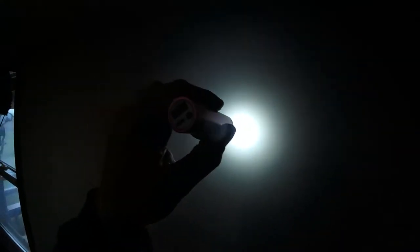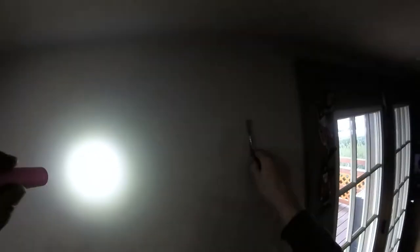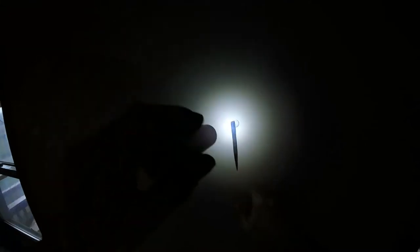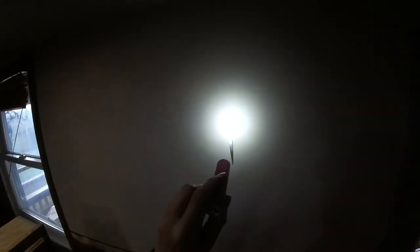Generally, if you have an outlet, you're going to have a beam running out. And I lost my shiny spot. Right there, right here. So I found that 16 on center over here. Oh, had it. See, I got it with the neodymium magnet. There's my shiny spot. Got it. I got a drywall screw. You're going to be careful because of power lines. You want to be careful.